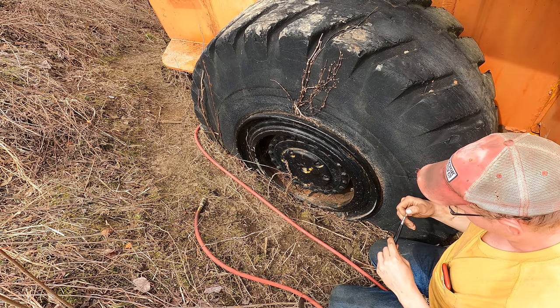And I replaced a couple lines here. I did it hastily and didn't bother to record it because that guy was on his way and I didn't know if I was going to have to move the machine for him to work on it. But you see there's a fuel line that goes from this side of the machine over to there and down and around and up. That was dripping, so I replaced that. And I replaced that transmission hose right there that was leaking. That's the main pressure line, where you put the fluid into the torque converter. So now that that's fixed, we should be good to drive it.